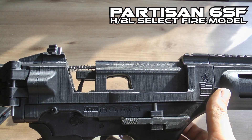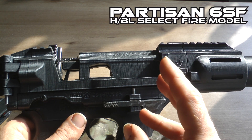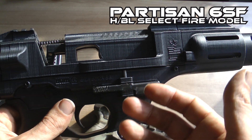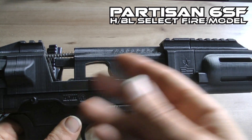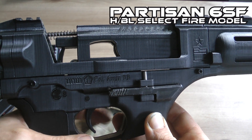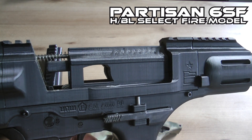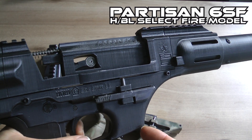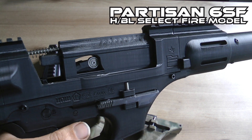The best approach is isolating components and troubleshooting from there instead of looking at the entire picture. Also keep in mind that when you shoot this fast with green gas, there will be a lot of cooldown in your magazine that will lower the pressure. Don't necessarily blame it on the green gas if there are other issues. But if you can only do short bursts and it can't do that reliably on green gas, there's probably something going on in the system. To be fair, don't expect to do an entire mag dump like with compressed air using a green gas magazine — that's not a realistic expectation.